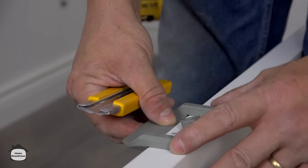The next step before we can add the doorstop and trim is to core the door for the locks. I'm using a laser level here. I know 35 inches from an unfinished floor is normal for the center of a hole, but I have a 78-inch door over here. What I'm going to do is center my handle right off the existing door handles in the other part of the room so that visually everything lines up. I don't want the handles to be off-line — that would look a little cheesy. Once I've got that horizontal line, I'll pencil out that spot. This is four and a half inches wide, so we go to two and a quarter for the center of the hole.